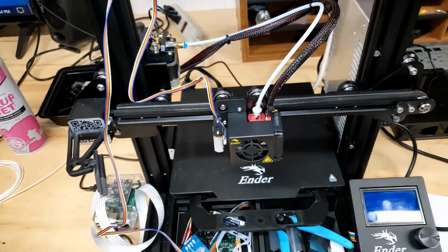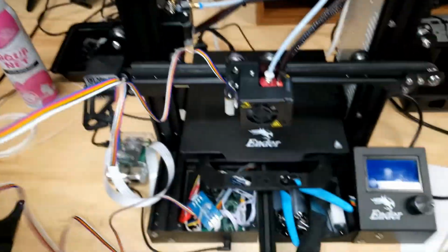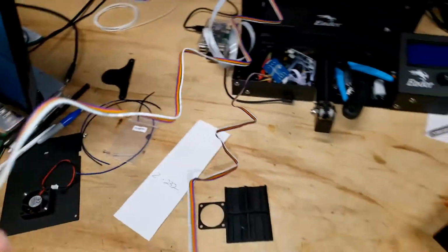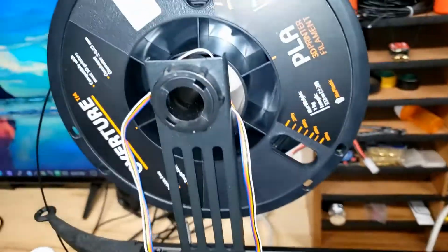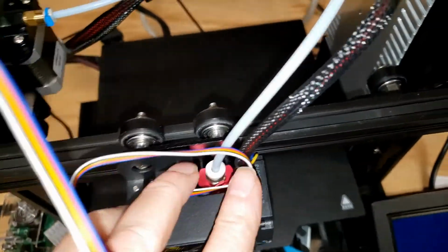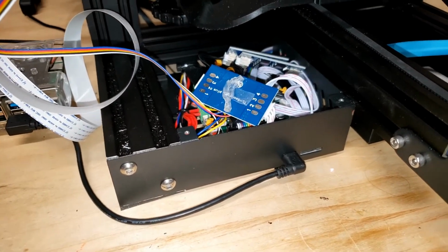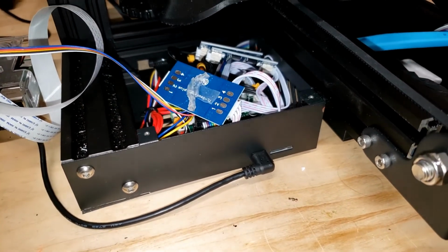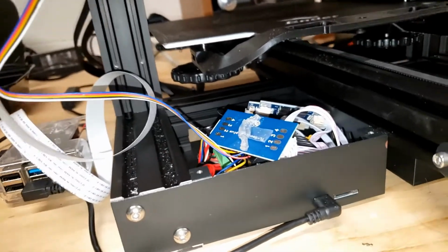I have to tidy it up now. This is the cable that goes from the BL Touch down to the system board that's just hanging out the front of the printer right now. I've got it looped over the spool holder up there. I've got to take this, move it inside this black sheath. That goes all the way down and around and inside the system board compartment.